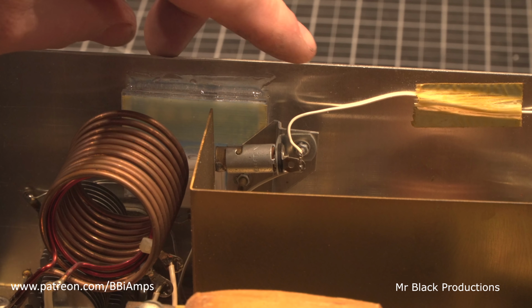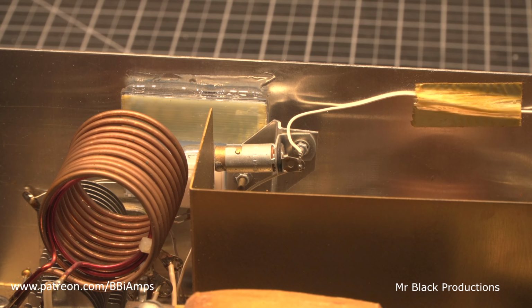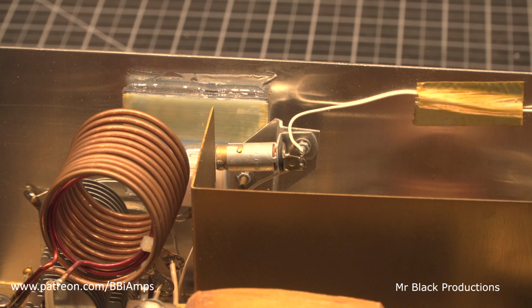Like I put down a layer of masking tape across the front of this thing, a layer of masking tape across the back, and I just laid a single bead of 5-minute epoxy across the back there, and that'll more than adequately hold that meter in forever. I wanted to get onto this right away because you can't replace that meter. If that meter gets broken, forget it. Game over. Meter broken forever. There's no such thing as a replacement part for that.